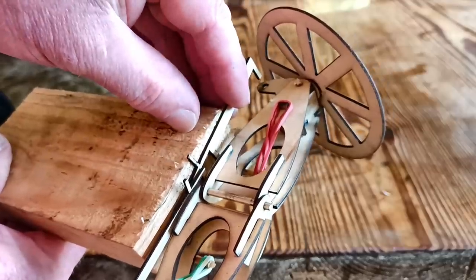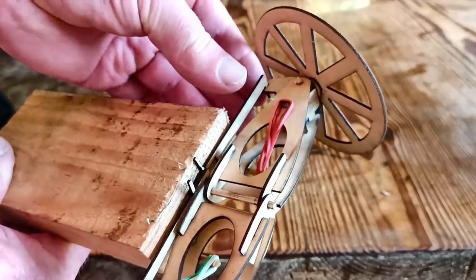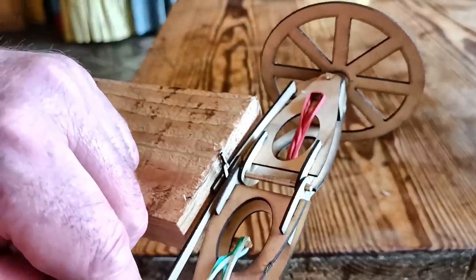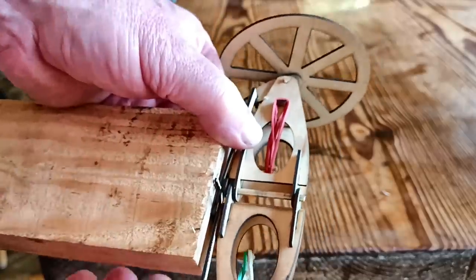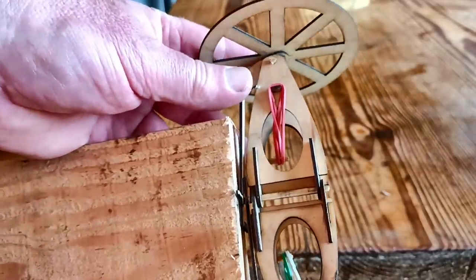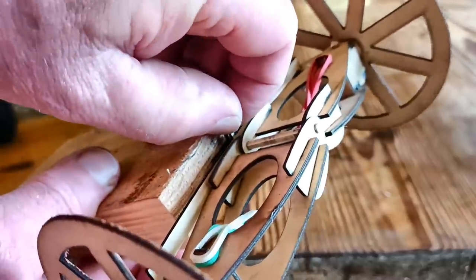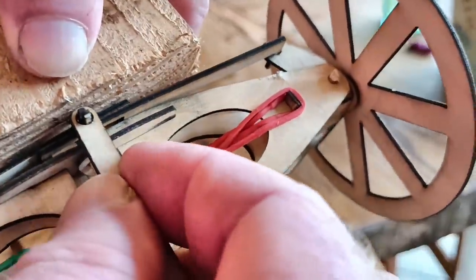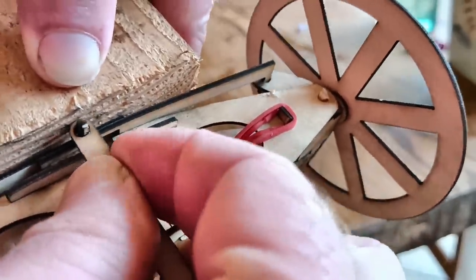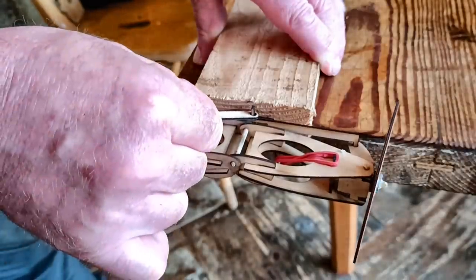But I still need to push them sideways to turn the wheels. That should be achievable with something which holds both of those little upright pins. Now, this isn't perfect because the pushing place isn't exactly in the centre of the pivot, depending on the thickness of the pivot itself and what the arms and connectors are made from. But it does reduce the effect of the changing distance by a lot. By enough? I don't know — we'll have to build a full size model to find out.